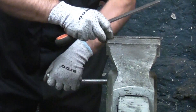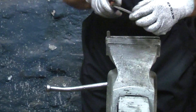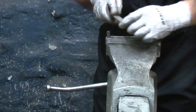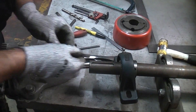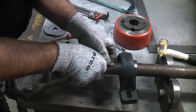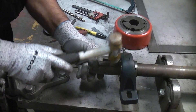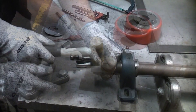You can remove the key steel at any point to check it in the keyway. Once you are happy with the fit you can then insert the key steel into the keyway. To do this you are going to need a nylon hammer or a copper mallet, as you do not want to hit it with a steel hammer as you could damage the key steel, making it harder to get the taper bush onto the shaft.